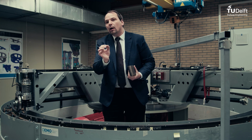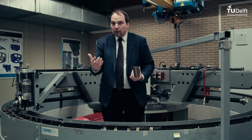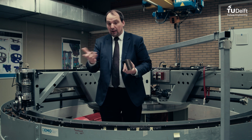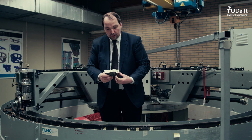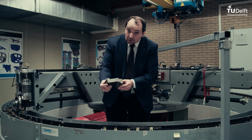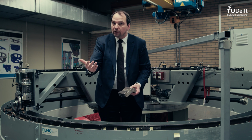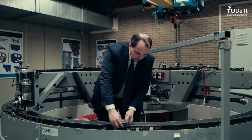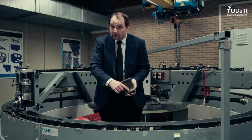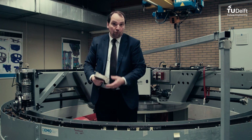And the question was, what kind of hard steel we need for tram rail or in the wheels to get rid of the wear? So you could also say, when you have a wheel with a flange, then you get a lot of flange contact. That means when the wheel is going over a sharp curve, and that's what we have in tramway because it's always in the city, then we always have a problem to make this curve. And therefore you get a lot of wear on this side of the flange, and also on the gauge side of your wheel.